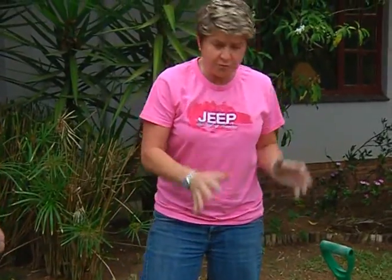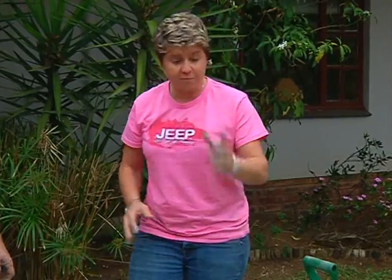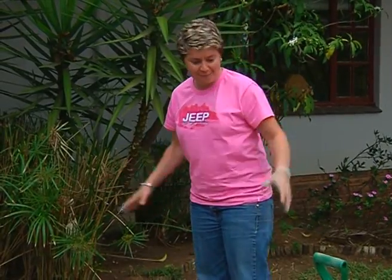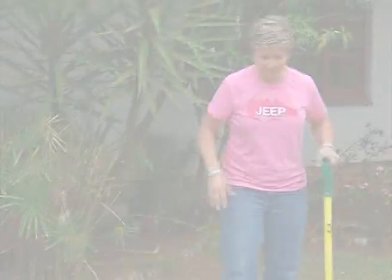Because we're dealing with quite a large quantity here of the 3 parts of plaster sand to the 1 part of cement, what we're going to do is empty it onto our board, the board that you always need when you're doing DIY projects, and then we'll add the water onto here as our standard mixture.